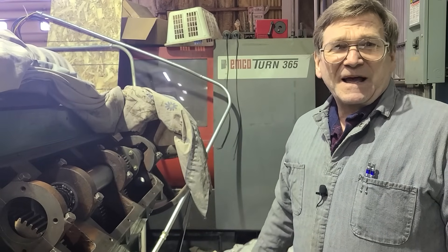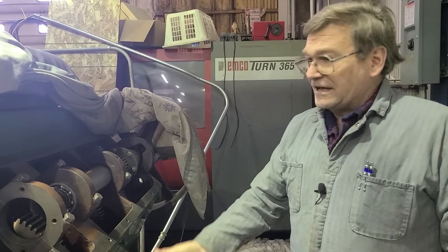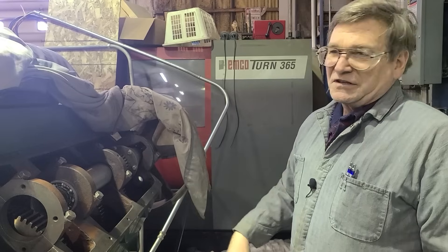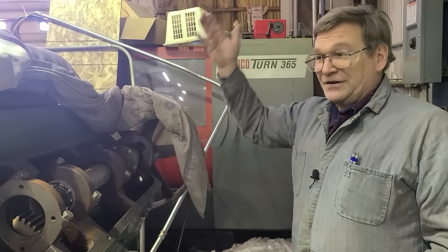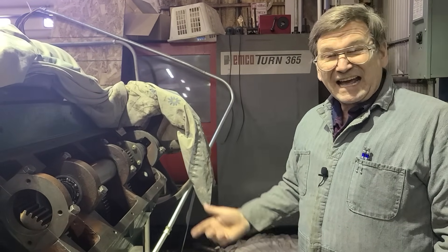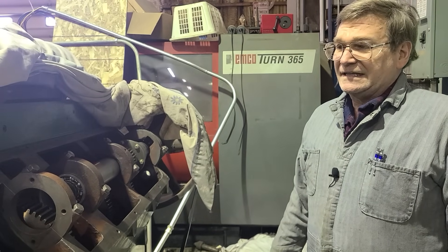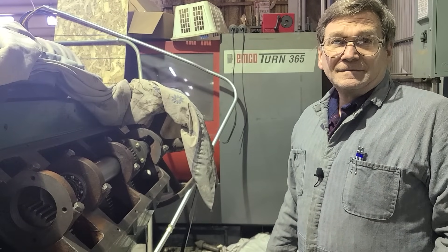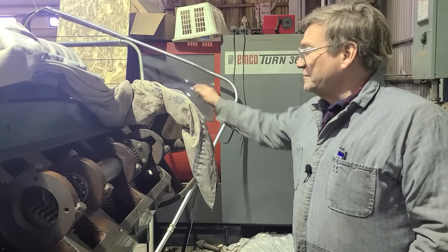So, yeah, clutches go a ways back on machine tools. And it's nice to have the clutch that's forward and reverse. Now this one here, we did away with the clutches. We're doing one speed. We're going to have it set up with an inverter so that we can do just like we had with the drill press. We might have a jog button on it too, but it'll have good enough control that it's not worth fussing with the clutches at this point. We have other methods today, but clutches are a thing on machines.